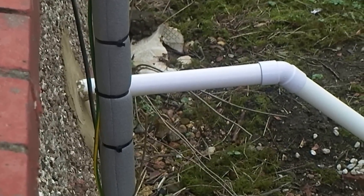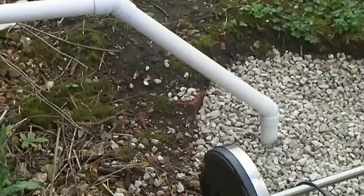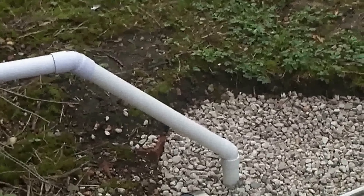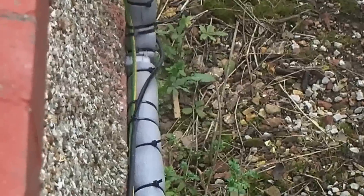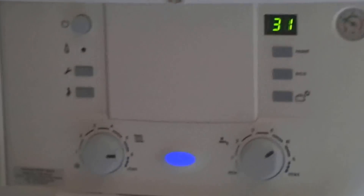We had the pressure relief pipework and you can see there that is the condensate pipe running down from there, straight through the wall out the other side. That's all got to be insulated. I've dug the condensate soak away - that is the limestone chippings - half a meter deep and it must be 500mm away from the wall. You can see the gas pipe; the only reason that's got insulation on it is just to protect the joints from the weather. The earth runs straight along to the meter box.